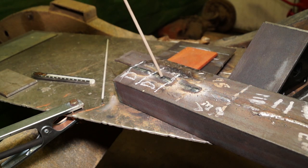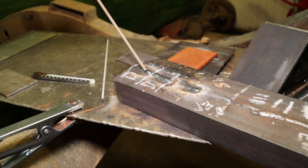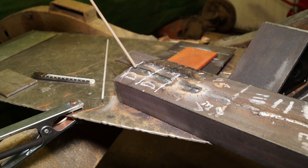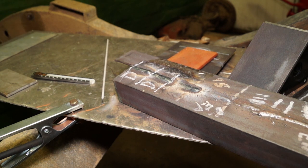This is almost perpendicular, which you need to have really, because that is where you get most of the heat. If you lean it over, the weld becomes colder and it stacks up higher, as you can see here. There's something to remember because you will at some point actually need to use that technique.